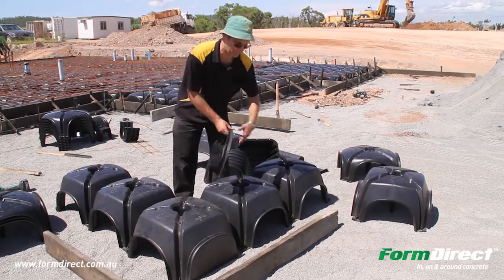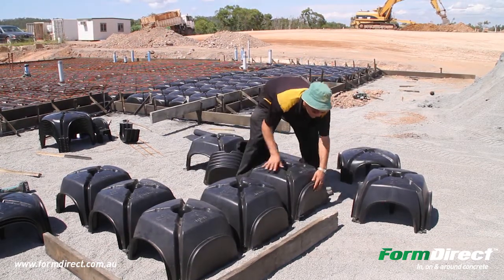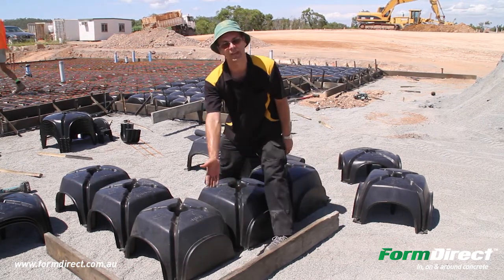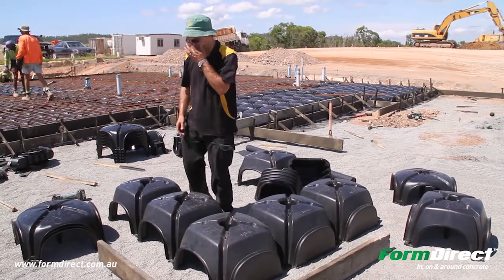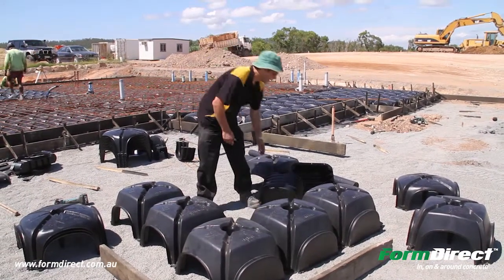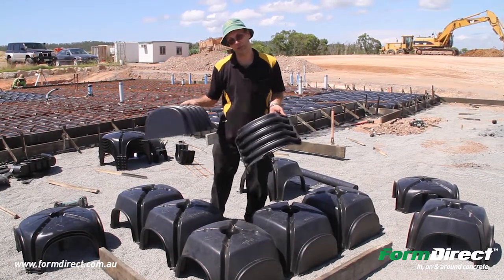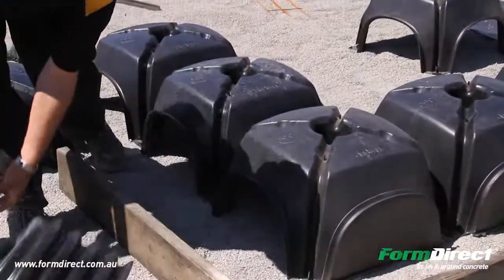So you would have 0R on one side — you put your 0Rs there, measure your 300mm wide, and your trench mesh would fit in that beam. On the other side, you might have a 2R, because like I said, you don't cut the domes, you adjust. This is your adjustment to get to the right side, which will be shown on the engineer's drawing.